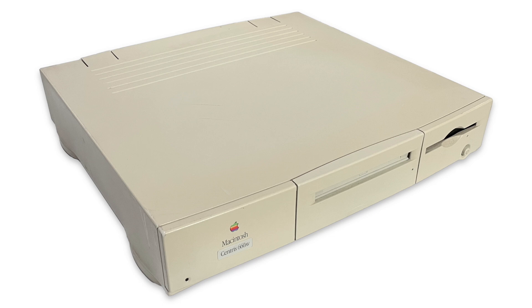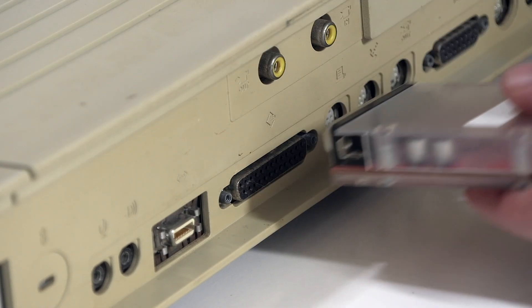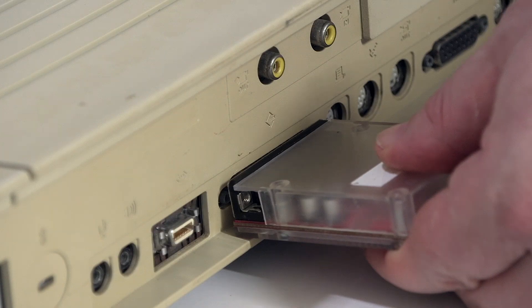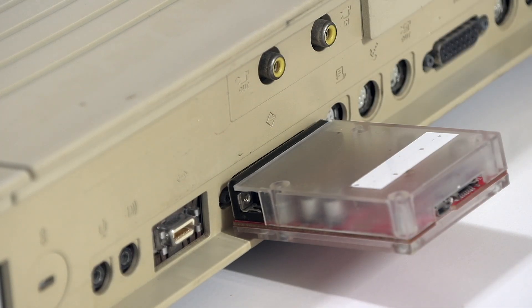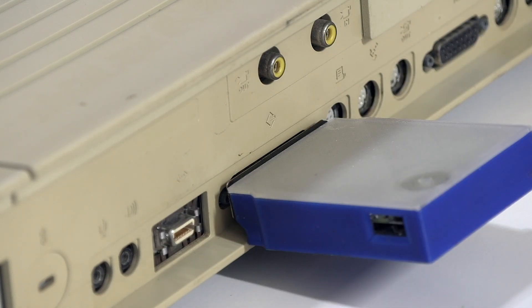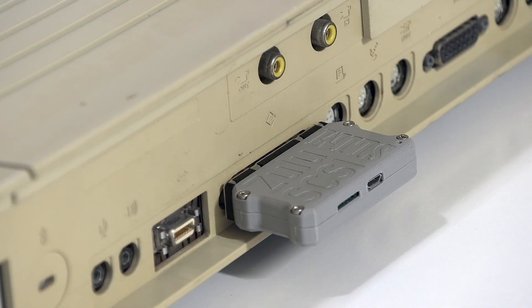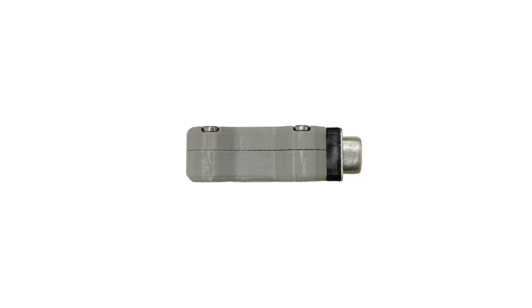This large pizza box case was also used for the Quadra 610 and the Power Mac 6100. If you look at the back, there's a ridge of plastic right under the SCSI connector, which prevents many other external SCSI emulators from being used easily with these Macs. The Mac 2CI, 2CX and Quadra 700 have a similar problem. The Zulu SCSI Slim is so small it doesn't bulge out the bottom like other external SCSI emulators. Even in its protective case, it's the same thickness as the SCSI plug, so it can easily be used with these problematic Macs.